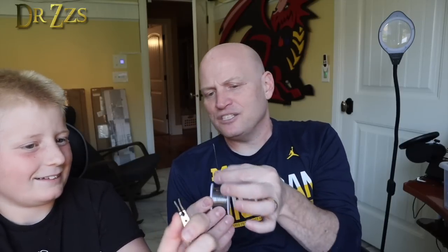Tip number three is small gauge solder. This is about the smallest you can get — it is 0.6 millimeter. You might be able to get smaller, but this is small enough for sure. If you are working with solder that's real big, real thick, then it's a little harder to do just tiny little things. So what's number two? Helping hands. And number three? Thin gauge — because you can buy this in different sizes, and this one is really thin.